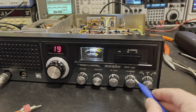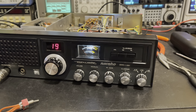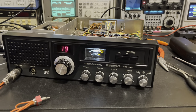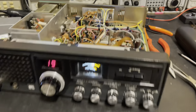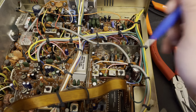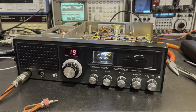When I'm done, my clarifier will be centered — the center slot will be at 12 o'clock — and I will not have to pull this knob and readjust or do anything crazy. I will get this aligned on AM, lower sideband, and upper sideband, with the center slot at 12 o'clock. I'll use both receive and transmit offsets in conjunction with each other. Some people suggest adding a picofarad capacitor to your trimmer capacitor for lower sideband to give more adjustment, but you've already got all the adjustment you need — there's another trimmer capacitor right there for lower sideband, and these two can and will be used in conjunction.